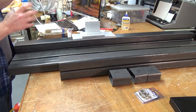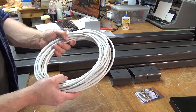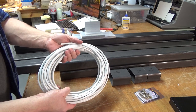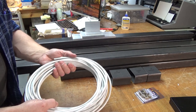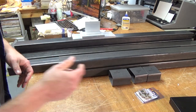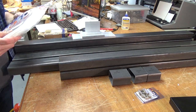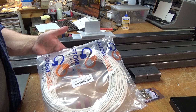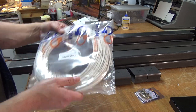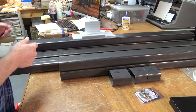You will need wire. This is 18-gauge, 4-conductor, double-shielded wire — wrapped with aluminum foil and with an internal shield wire. This is what you'll use for your spindle wiring, because spindles are very noisy electrically. This is the wire for the stepper motors — 4-conductor, 22-gauge, which is perfectly capable of carrying the current the steppers will pull.